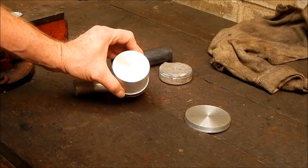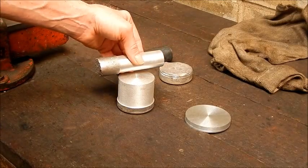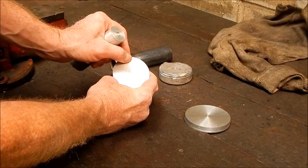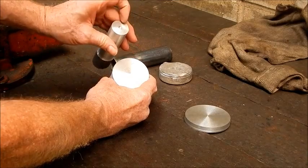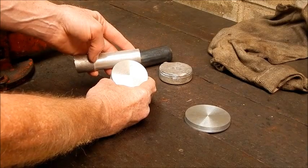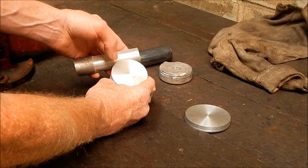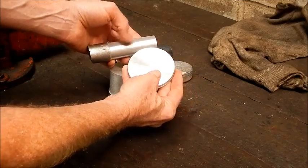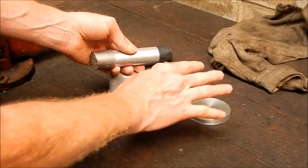This is aluminium from end castings on an old AC motor I had, and these two are the same sort of aluminium. You look at them, you can see that the one with the washing soda's got more hydrogenation than the one with the baking soda. But I only used half as much in that one as I did in this pour. So at the end of the day, there may not be a lot of difference between the two of them. You're just going to have to experiment and find out for yourself. But certainly the grade of the aluminium has a big effect upon hydrogenation and machinability of it. And you can see that this has got a much better luster than that. No hydrogenation whatsoever. So it looks like get some good aluminium to begin with.